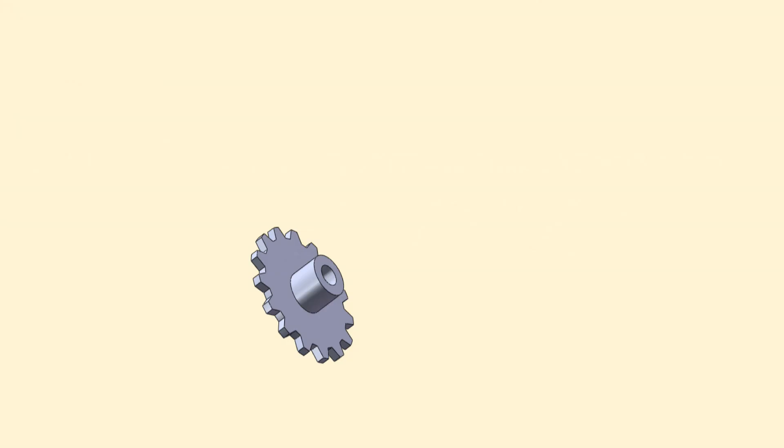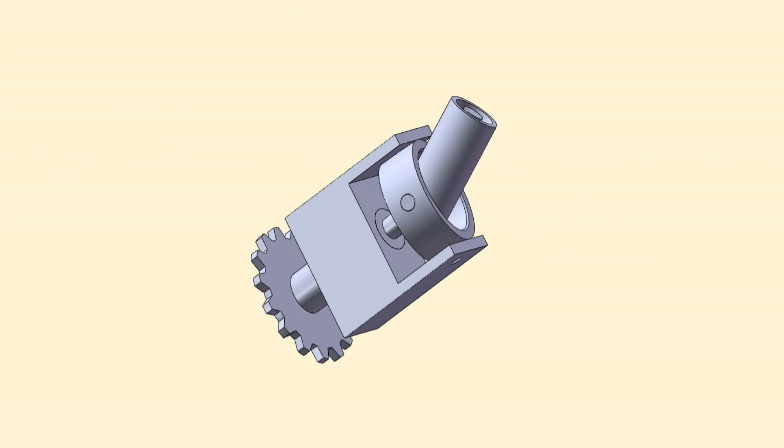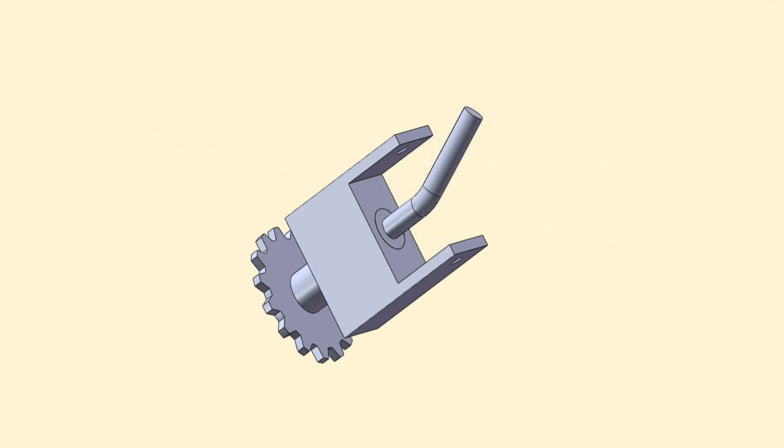There are some struts on the top too — they're just harder to see. This longer strut supports the front wing. After studying this for a long time, I realized that what we're looking at here is a gimbal mechanism. You can see the ring and the axle. This is what keeps the wing upright as it's going around in a circle. This is where the wing attaches to the gimbal mechanism. So you have the drive sprocket, the supporting structure, and the gimbal mechanism. When we hide the gimbal mechanism, you can see the bent rod inside that drives it around in a circle.